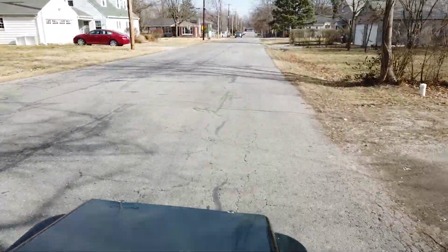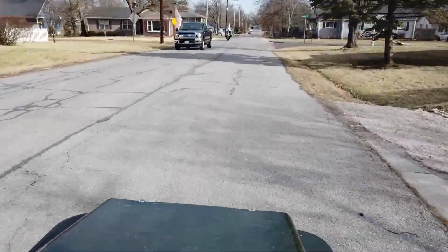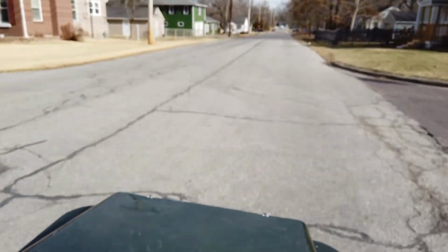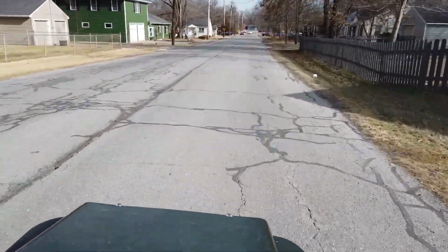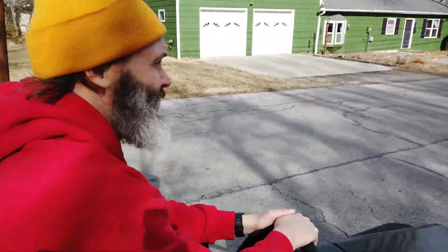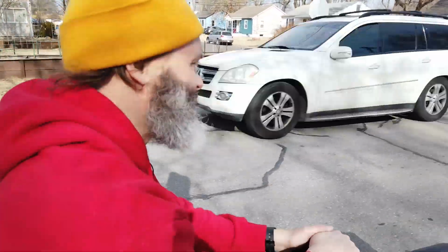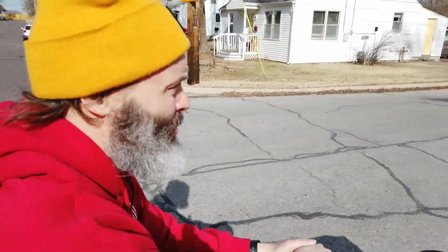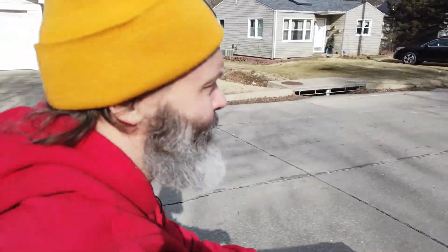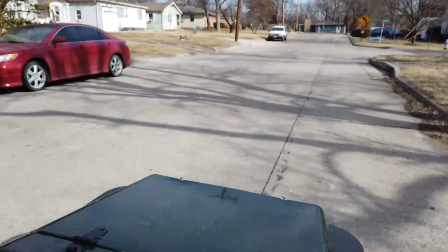See, downhill we're fine. It's just not giving us enough amperage is all that it is. You know, maybe I can just modify the shunt first, but if I modify the shunt, that controller is not going to be happy. It's going to get hot and it's probably going to smoke, and that might take out my battery at the same time. So it's all a risk. But I got more controllers, I got more batteries, and I guess I can order more motors. I don't have these particular motors, but maybe they make one that's twice as long. I would enjoy that. That's my type of good time.